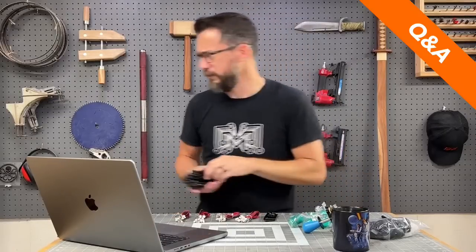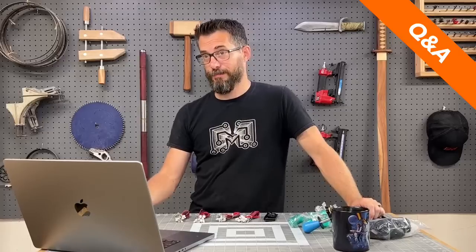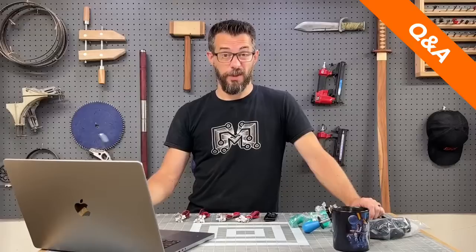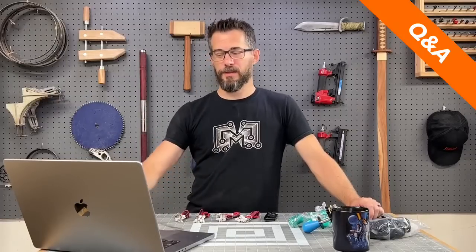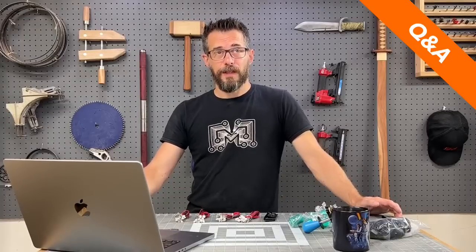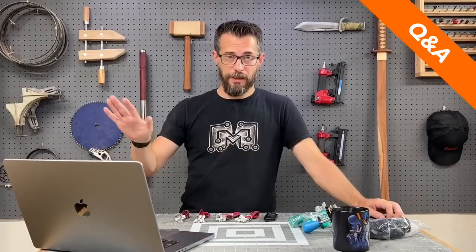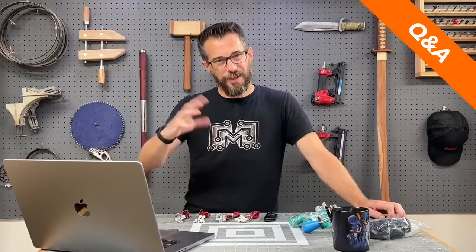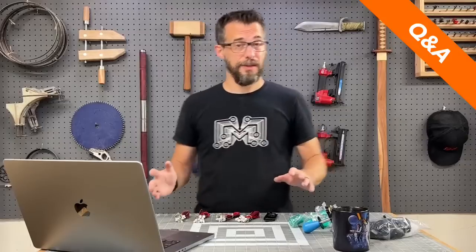For a general purpose workshop, what is more versatile, a CNC router or a laser? We did an entire video on this. If you go back and look at the video about making the Tuscan Raider workshop sign for Brian Kessinger, who's an awesome artist, we made that video to show some of the differences between a CNC and a laser. Again, like what I said with the saws earlier, it depends on what you're going to do with it. If you think you're going to have to cut through 3/4 inch plywood or engrave something deep into it, CNC, hands down, because the laser can't do that. If you're just going to decorate things or engrave text, or cut out thin material, 1/4 inch, maybe 1/2 inch material, a laser is awesome.